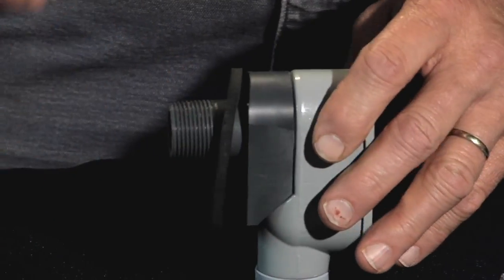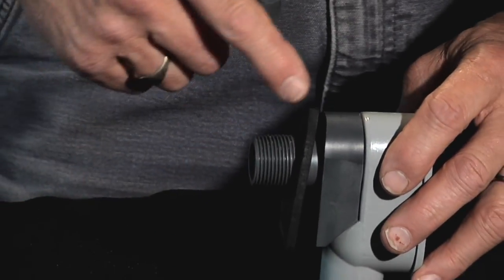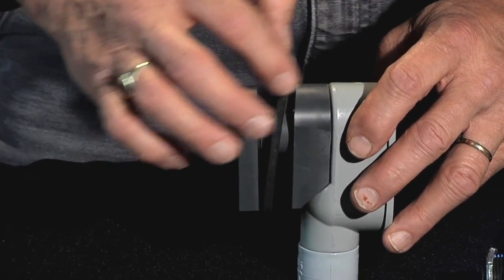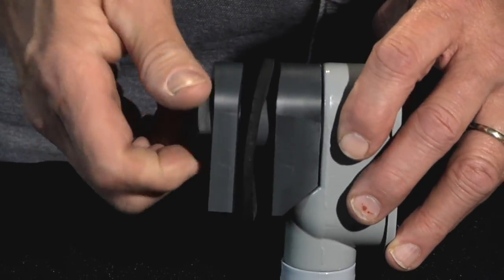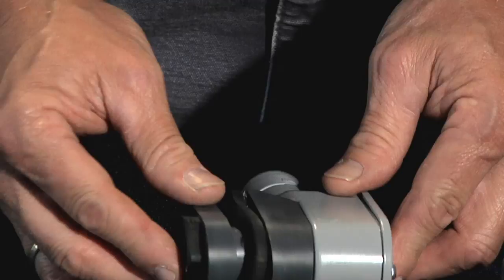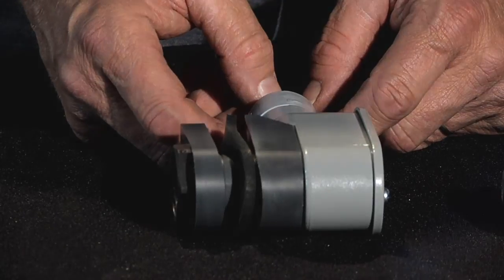On the inside of the casing, the other half of the plastic seal — again the contour is cut to fit the contour of the inside of the casing. Now we've got our casing sandwiched between these two fittings, and you simply turn the nut on and tighten it up by hand in just a couple short turns with a pair of pliers. You don't have to tighten it very hard, and it's done. Now you have a watertight Conduit L. The rest of the process is just the same as the old L.